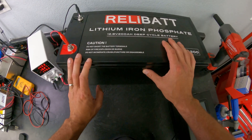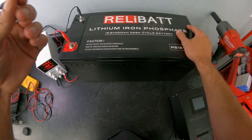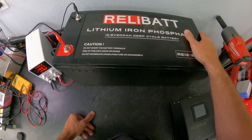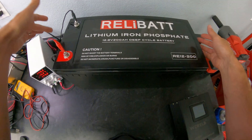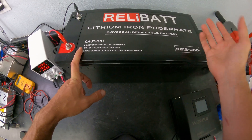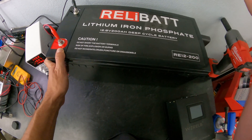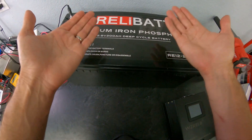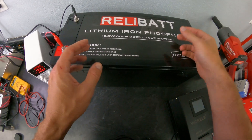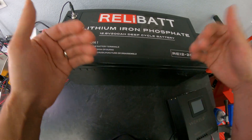These batteries are capable of deep cycling — drawing down quite low in voltage, similar to marine deep cycle batteries. The nice thing about lithium iron phosphate batteries is they all have what's called a BMS, or Battery Management System. That BMS manages each individual cell. Inside this battery there are four cells, each running at about 3.3 volts. The BMS communicates with each cell to keep a constant state of charge, making sure they all remain equal so no single cell does all the work.